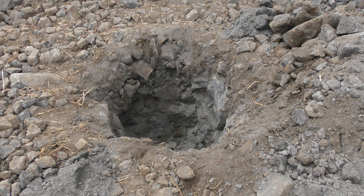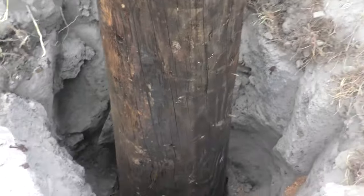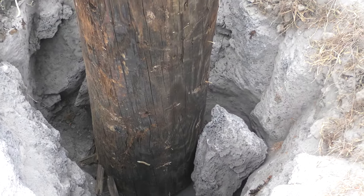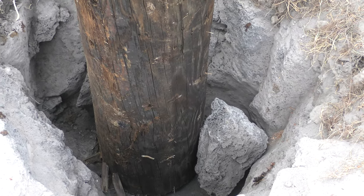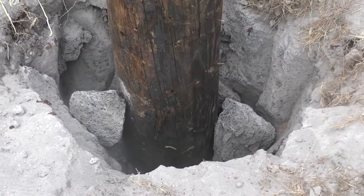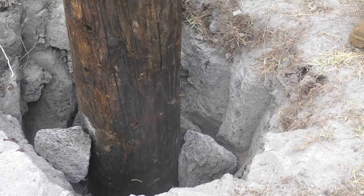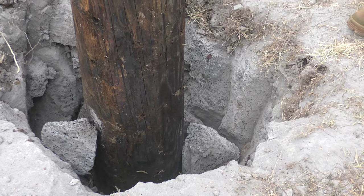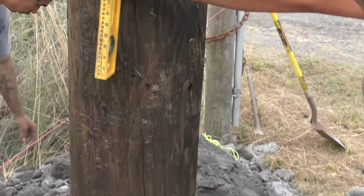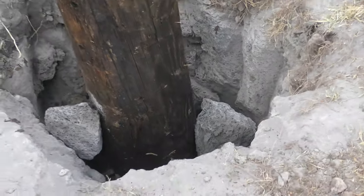This way I only had to get one piece of wood and put it in the corner. The rock is so hard here that one hole could take a day — the one right here that we're filling up took four hours just to dig. Once you make sure that it's plumb and level, you put in some big rocks to help stabilize it for when you put in the cement. After you throw in the rocks, double check it and make sure that it's plumb.